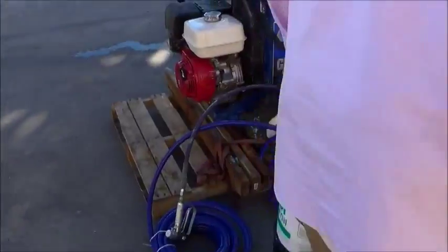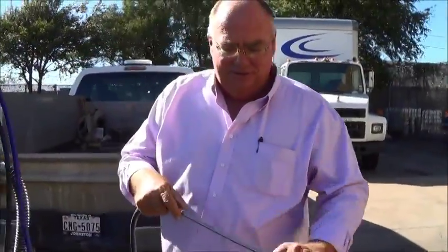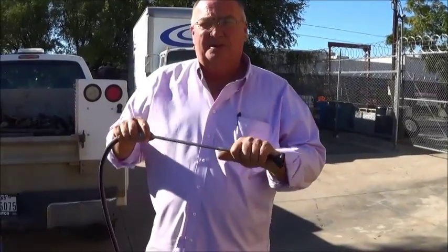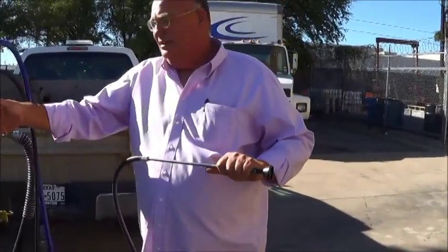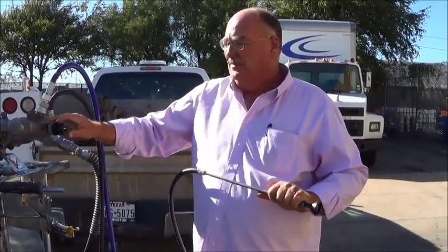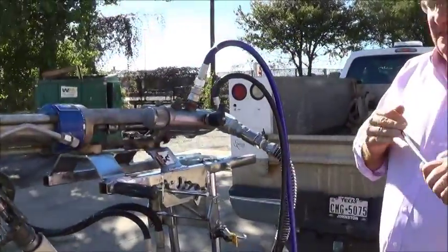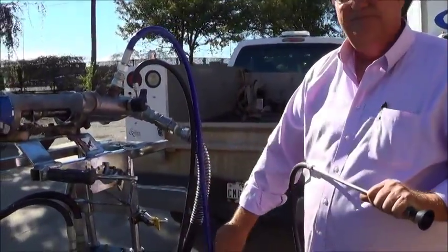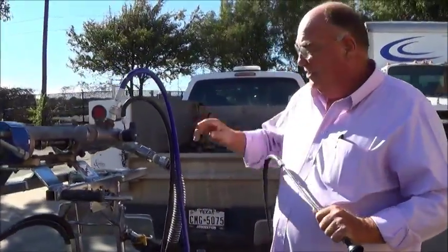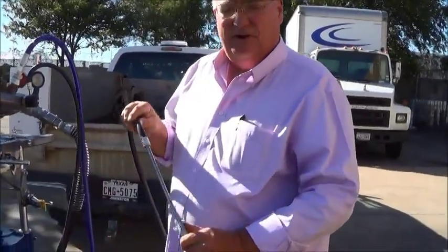Also on your prime tube, take the time to clean the outside of the tube, get any of the skim that's developed off. Put this also in a bucket of water. This seals this line to where air cannot get to it and begin to dry. With it in this spray position, that seals this entire line here, allowing no air to enter the chamber here. But this is the critical part. This has to be immersed along with the gun.